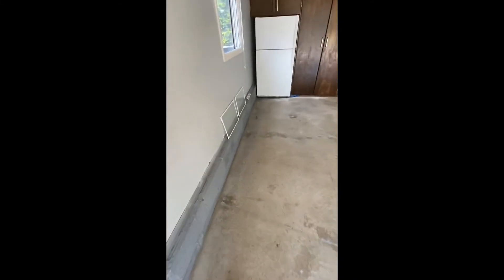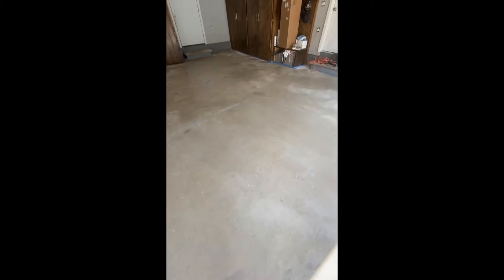The most important thing I want to state again: preparation is the key to a successful, smooth epoxy floor. If you don't do these things, you're going to fail and you're not going to be happy. Take your time — three days, four days, whatever it takes. Sand all the cracks you filled. If you have a cement floor with cracks and you do this, I guarantee you're going to be happy.